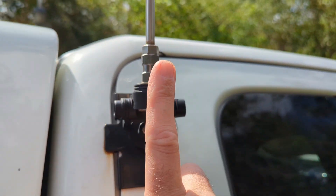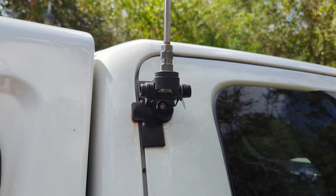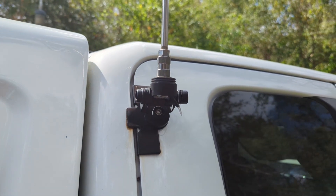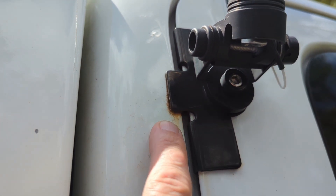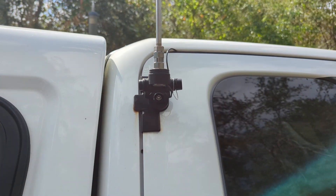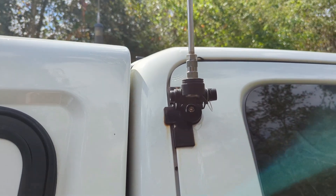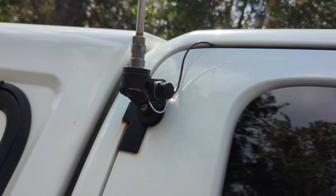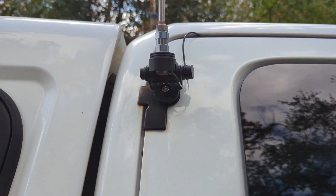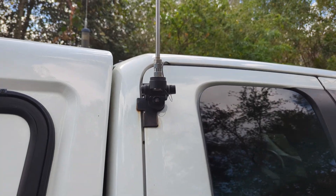For the Compact Tenna over there, the same thing. When I did my first video on that antenna I showed I was having an SWR issue — it wasn't the antenna, it wasn't me. Make sure before you go trimming an antenna that you have the right mount. You could see how the old mount was rusting on the door. Somebody told me years ago: give the manufacturer the spec — the mount you have is X mount and this mount is a Diamond. Don't ever say it looks the same with a different name. It's not. The Diamond mounts are definitely superior, and Comet makes a good one too, but if you get one from China, Amazon, or eBay, it's going to rust.